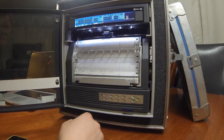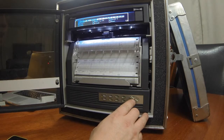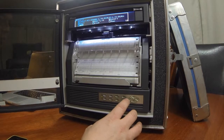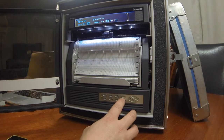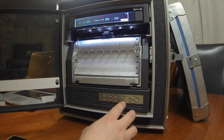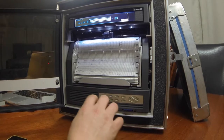With Channel 1 set not to record, we can easily remove all the additional channels in the recorder by hitting the F2 or function number 2 button to copy the channels. We need to select all the options we want to copy from the channel, putting check marks next to all these options by hitting Enter as we highlight each individual option. Towards the bottom, we have a source channel — our source channel is going to be number 1. Then we move to our destination channel, press Enter, and move our destination channels from 2 through 24. This will remove all channels from being recorded. Hit Enter, then select Copy at the very bottom again and hit Enter. Now it's copied all the settings from channel number 1 to all channels from number 2 through 24.